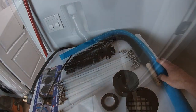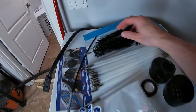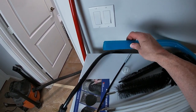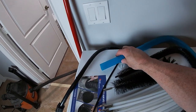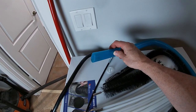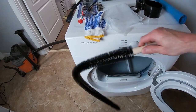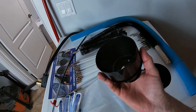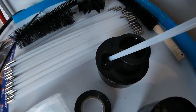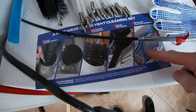The kit came with this really annoying vacuum thing which works really, really well. It fits down inside of this piece here - this is the perfect size - but you may want to get some earplugs because the whistling through this once it's turned on is horrendous. It could be because I'm using a shop vac and not a regular vacuum, but just in case, get yourself some earplugs. This thing is really good to loosen everything up as well. You can get really all the way down into there and clean everything out. The rest of this stuff is going to be for cleaning out the pipe in the wall. This is going to go over the pipe. This little port right here is going to be for running the drill through it and up into the wall. And this one is for the vacuum.